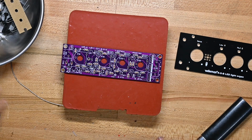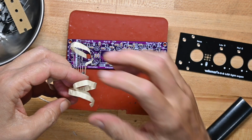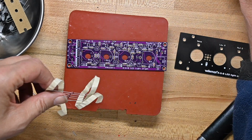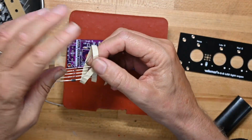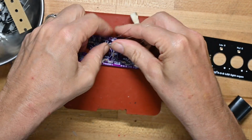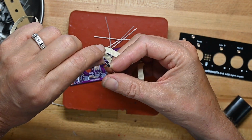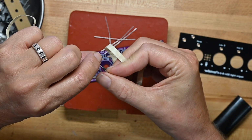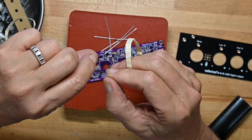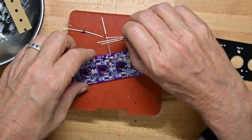And that's all the resistors on the board. Let me turn it right side up for you. We've still got some stuff on the strip. We've got some Zener diodes and one polarity protection diode, so let's take them all off. These are the 4148s, the Zeners, and this, I always forget the part number of this one. 1N4007, that's what it is. That's the protection diode.